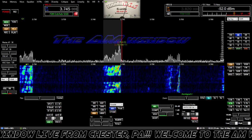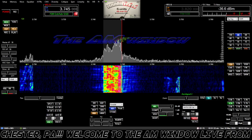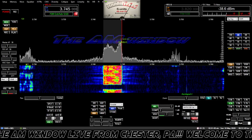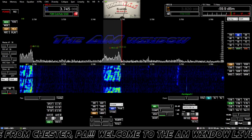Well, that's been brought up before. Maybe other guys have more insight than me, but with a lot of radios the IMD is a little higher at lower power levels than at higher power levels. But usually that's the case with extremely low power levels, in other words maybe 3, 4, 5, 6 watts. I don't think it's worse at 20 watts than at 100. I guess that's the downside of what Joe was doing at one time, starting with low power, amping it up to 100 and then hitting it again.